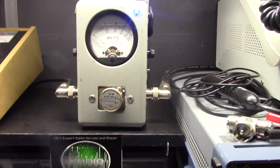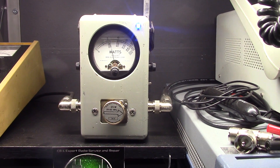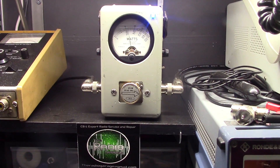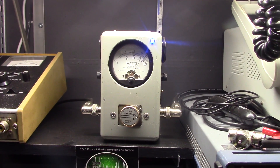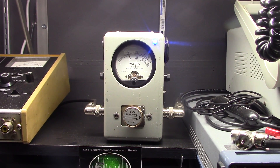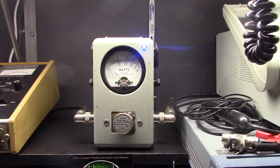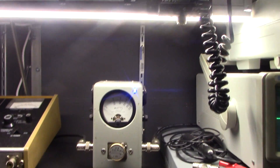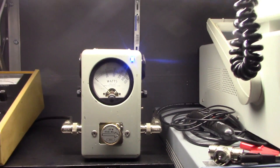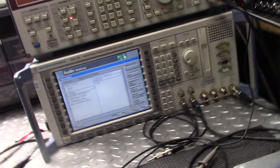Show it to you on AM — I'll do a carrier first. About six watts or so. One two three four, hello hello. Doing about the same in AM, maybe a hair under — just between that 15 and 20 watt mark. Like I said, that's a 25-watt slug, so we're reading the top scale the whole time. Let's do a quick show of how it hears.